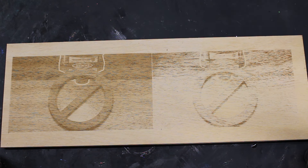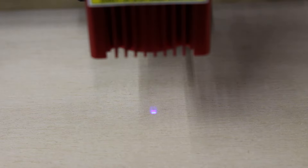That makes a lot of sense because we're defocusing the laser. So instead of having a very pinpoint focused laser that applies all the energy to one tiny spot, we've spread it out. Let's take a look at the size of the dots. This is the laser focused at the three millimeter distance — just a small pinpoint. But moving it up to 35 millimeters, it's a lot longer and wider. Basically, it's not a nice pinpoint dot anymore, which means we're not getting nearly as much power — and that's why in the image mode it doesn't work as well.